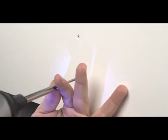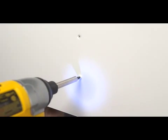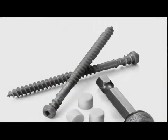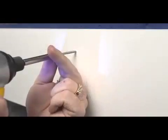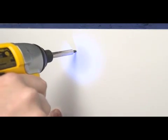VERSATEX can also be adhered with screws. In fact, screws work best to control expansion and contraction and should strongly be considered on long runs with multiple boards. As with nailing, make sure screws are long enough to penetrate a full 1.5 inches into the substrate. 2¼ inch Simpson Strong Tie screws are available with a painted white head to blend nicely with the VERSATEX trim.